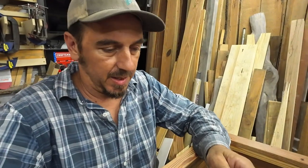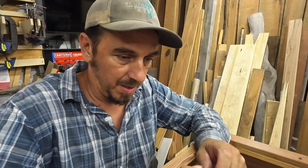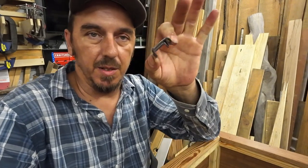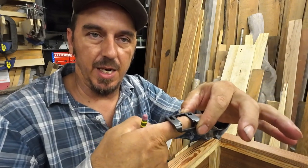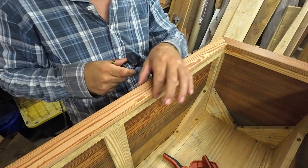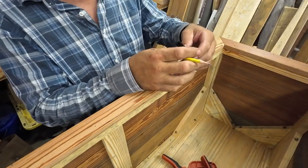Kind of messed up with these hinges. So this is where I messed up with the hinges. If you remember earlier, the hinges that I showed were flat to go on flat surfaces. And these here have this little lip to go on a 3/4 inch surface.